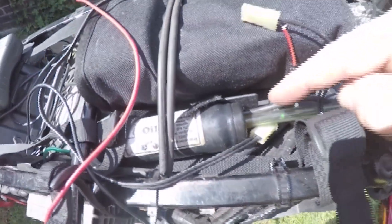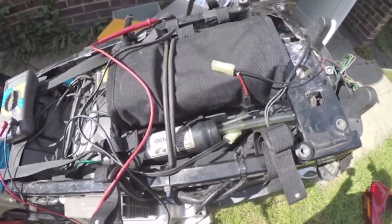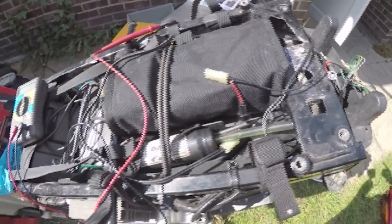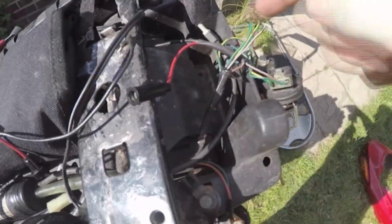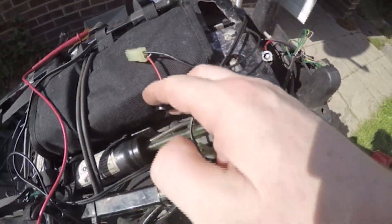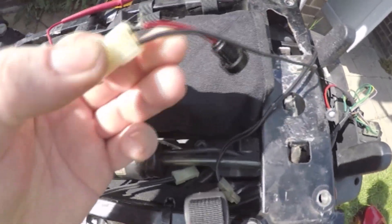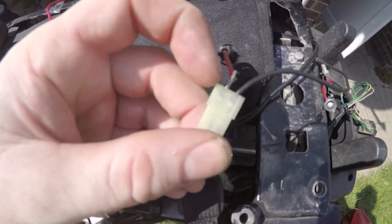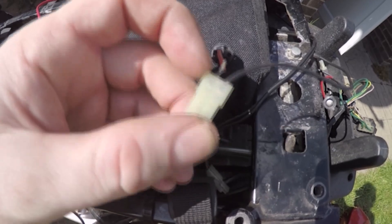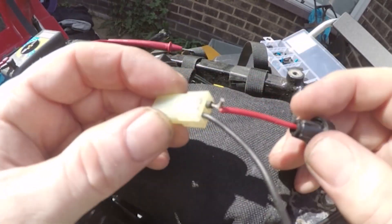So I did some digging around, and this is a perfect example of what I said in my last video as a dry joint. The person that put these in basically took the power from the rear lights, the side lights, fed it into the fuse. Now for some bizarre reason, they have decided to solder the wire so close to the actual plug itself. It is unbelievably close to the plug — I can't believe how close that actually is.